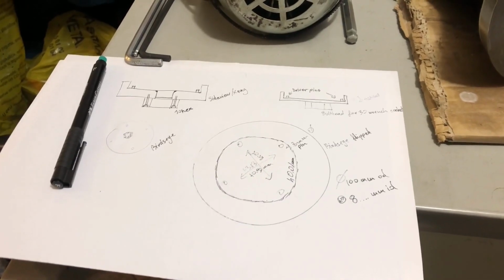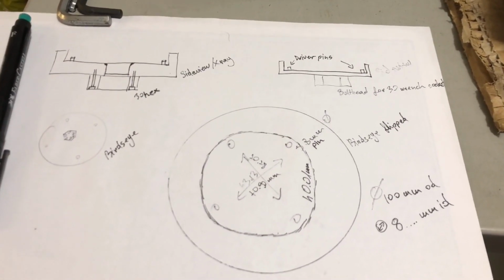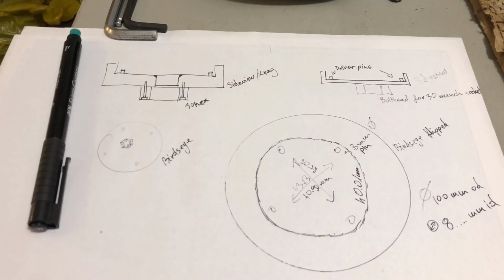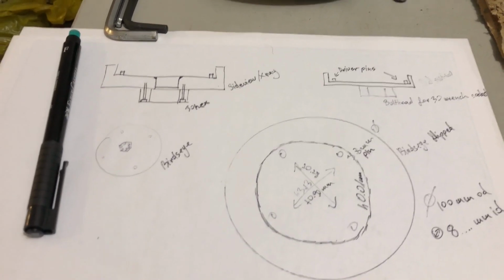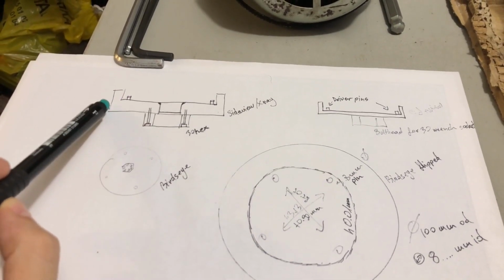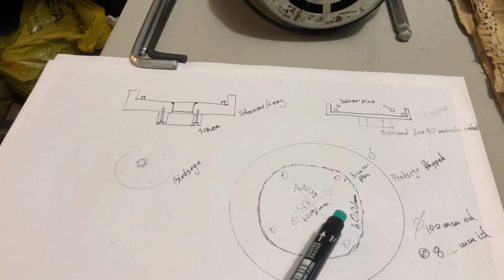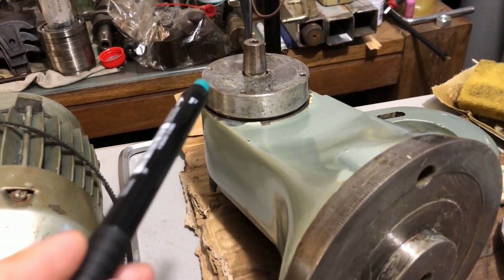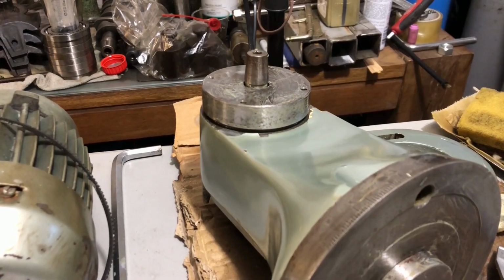This is the plan for the wrench, for the key, however you want to call it. It is just roughly sketched. Sorry, let me just anchor my hand a bit. Much better. So it'll be a ring with, as you can see, side walls that will have a 1/100 of a millimeter fit clearance for this piece. It's gonna sit nicely over the edges to gain positive registry.